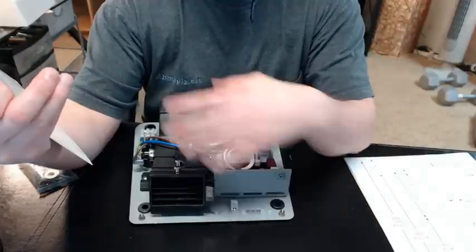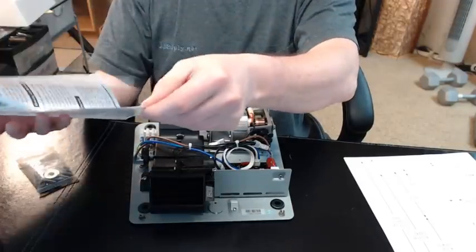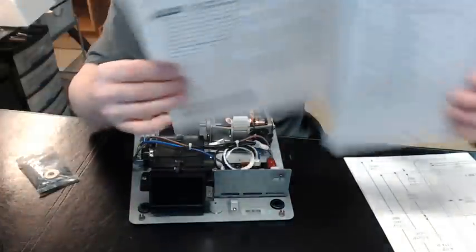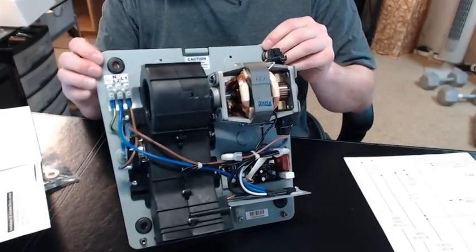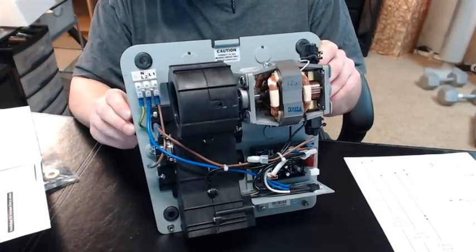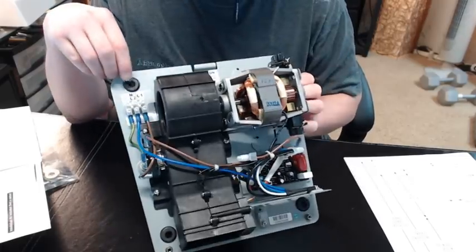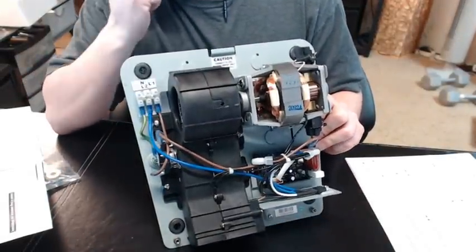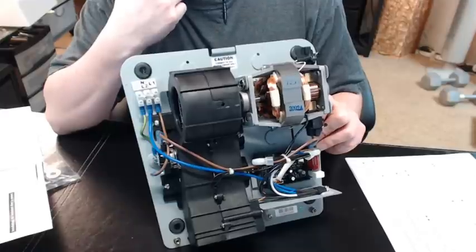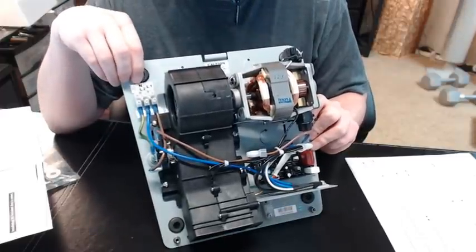So if you have your hand there and you pull it away, it's going to shut off after 2 seconds. Now, the question people ask is how do you wire it, and that's addressed right here as it is on the template I showed you. The black wire — your live wire — gets connected to your L1. This is a terminal block; the wire goes in there and you tighten it down — don't over-tighten it of course. Your second wire, neutral or second live wire, red, goes to the L2 or N/L2.